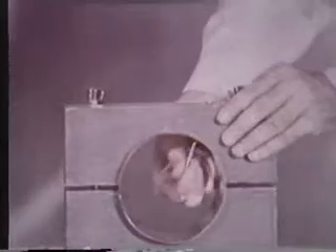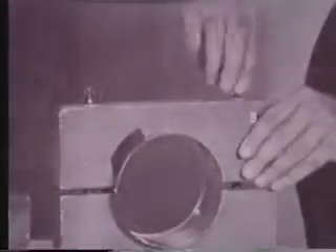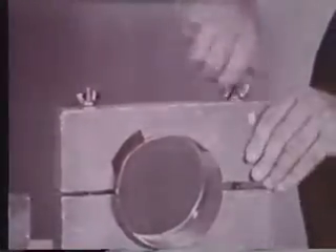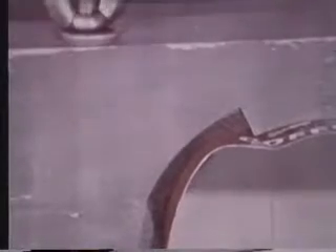However, if there is improper support, such as poor backfill material, the walls might buckle into the soft area when loads are applied. This would cause the conduit to lose its conformation and ultimately its effectiveness. These simple demonstrations of the importance of good backfilling practice have also been verified by more than 30 full-scale field installations.